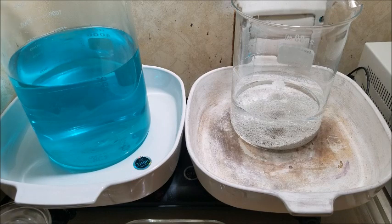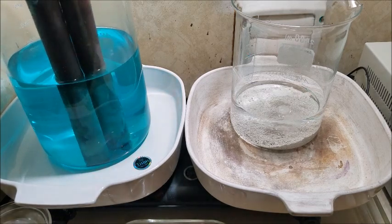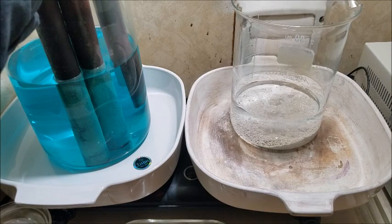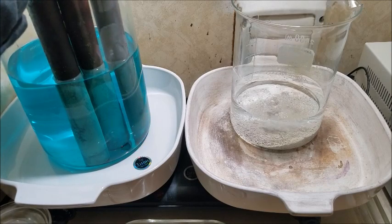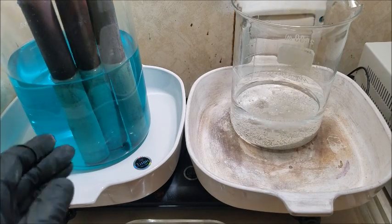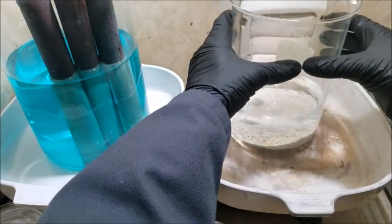All right, and then over here, we have our spent electrolyte. We're going to make this real simple. We're just going to drop some used copper into the electrolyte, and fairly certain we're going to see an immediate response. One more here I'll put in. We'll watch this drop the silver out as we watch this heat up and start to put our silver in solution.